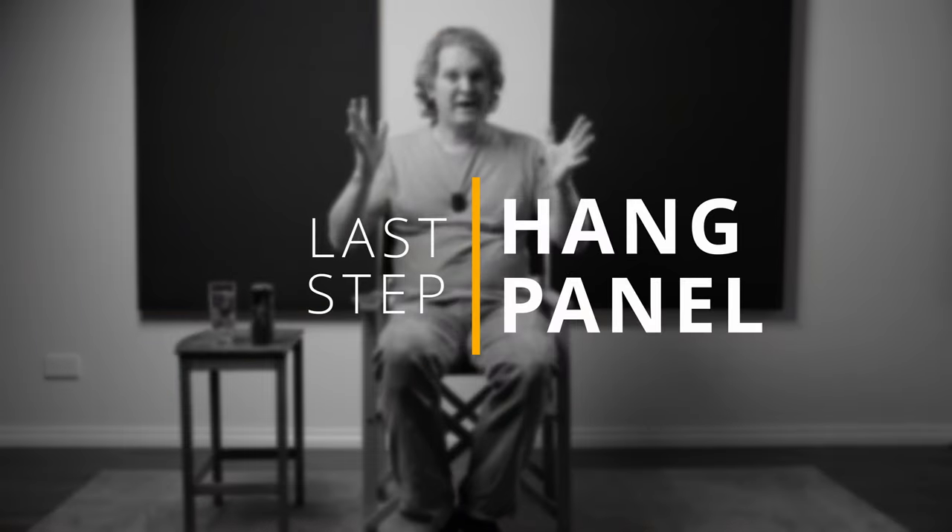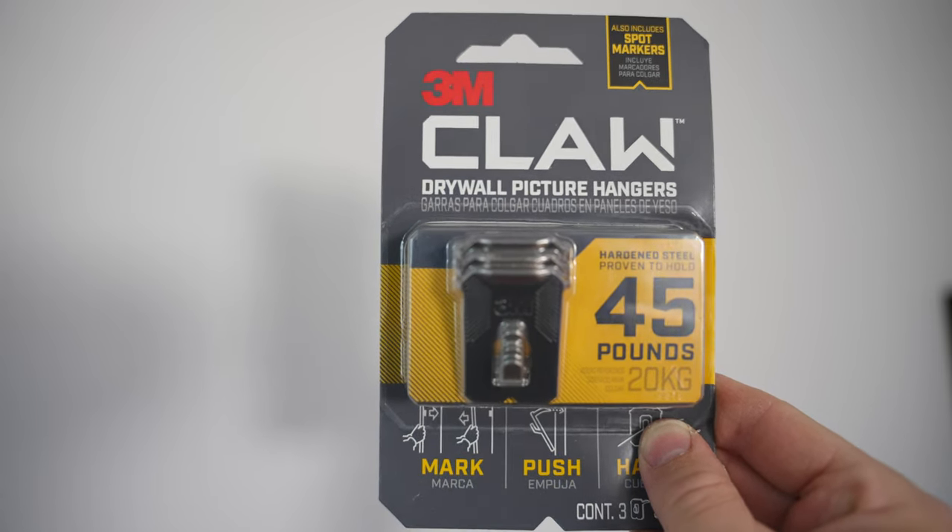The final step is to work out how to hang the panel on the wall. There are loads of different options. As a quick disclaimer, make sure whatever method you choose to hang these panels on the walls or ceilings is super firm, super secure, and super tight so it's not accidentally going to fall on somebody or damage equipment. What I didn't want to do was drill into the wall, since at some point I'm going to have to leave this space and move to another studio. I found these really interesting claw hangers from 3M — drywall picture hangers that come in different strengths. The ones I chose were rated up to 45 pounds or 20 kilograms. I weighed these sound panels and they came in at roughly 8.5 kilograms, so well within that 20 kilogram maximum hanging capacity.